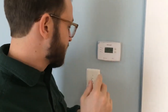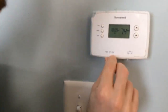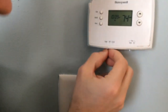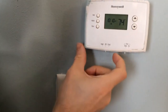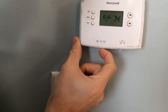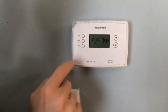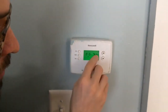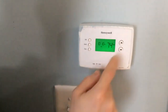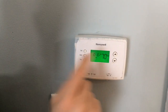Other things we just want to check and make sure our thermostat's working. We've got the options of having it heat, off, or cool. We don't have a cooling system here, but remember, of course, if the switch is on off, it's not going to call for heat. So we're going to switch it over to heat. And to keep the system simple, we press hold. So, and we can see it's set to hold, and then we set the temperature to wherever we'd like it to be. Right now it's set at 70,